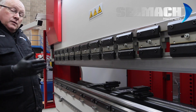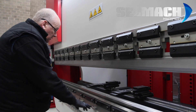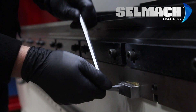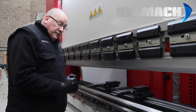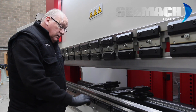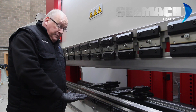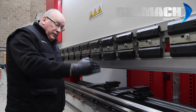You can bring those two degrees back up by adjusting the center wedges. By tightening them you will bring the bottom bed up. By loosening them you will take the bottom bed down. That's a bit of an exaggerated crown effect.